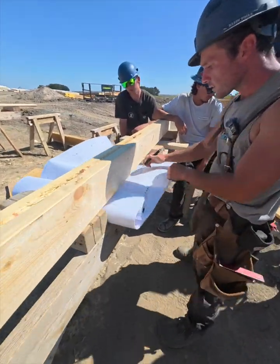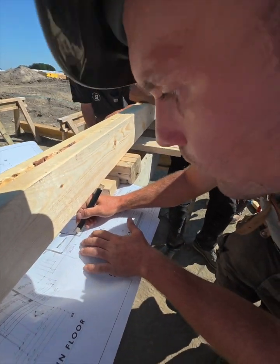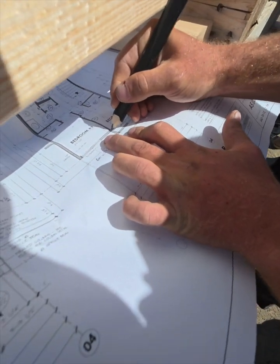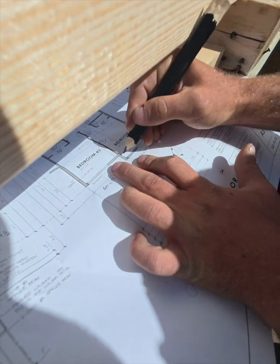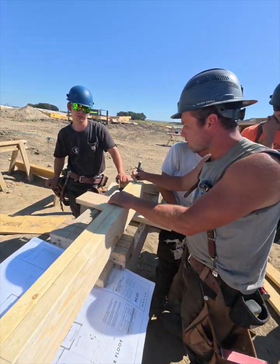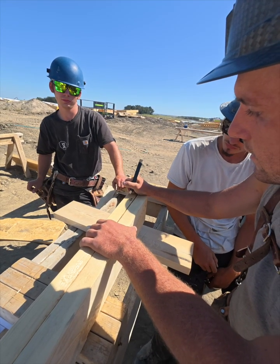And then over here, right here, we're gonna also run the top plate over, but I'm gonna run it over the width of this wall, maybe just a hair less. I'm gonna run this over 6 inches. That's for the 1/2 inch plywood and the 2x6. So I'll put a stud mark on the end and I'll say over 6.